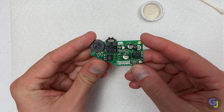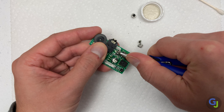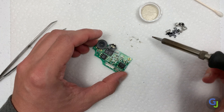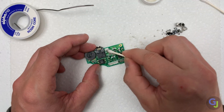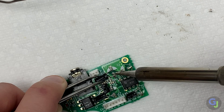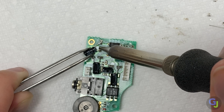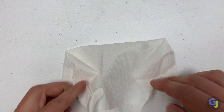The soundboard, however, has more SMD caps, so do the same process as we did on the main board. Cut them off, remove the bases and legs, remove the plastic parts too, then add some new solder to the pads to get them ready for the new caps. Clean up afterwards and add your new caps in place. The difference with this one is it's a small board that needs to fit five caps on it and it's really tight. Pay special attention to the top right caps since the cartridge shielding covers that area when installed. Once you're done with this one, it's time for reassembly.